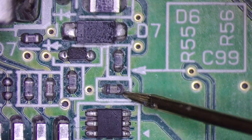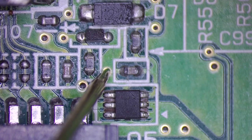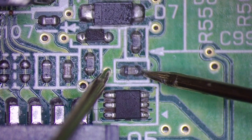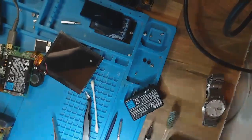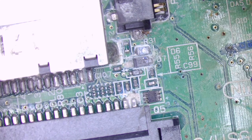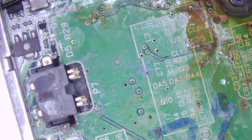That must be a capacitor. The only corrosion I can see - a problem with the board - was around this component, and it says capacitor 99. I'm looking at this capacitor which has got continuity on it; I wouldn't expect a capacitor to have continuity on it. I wonder if I can test that capacitor on this blue one. So I'm going to take that off, swap it over, and take this one off - grab my tweezers.